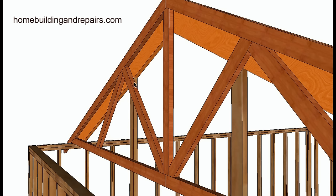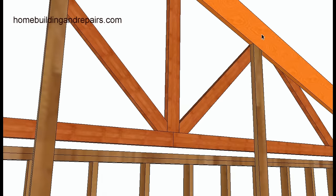I will leave that up to you. You can screw them to the framing, use straps, whatever you feel you need. You could always install a flat A35 strap and use screws until you need to take the wall down.